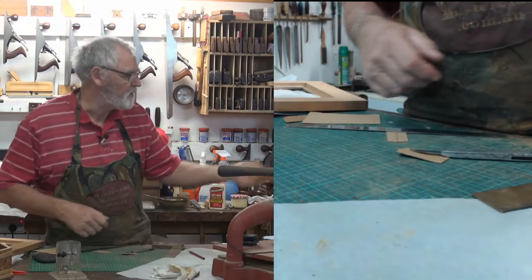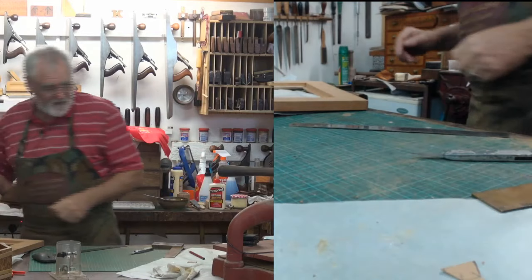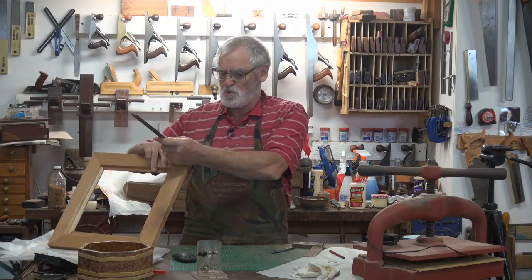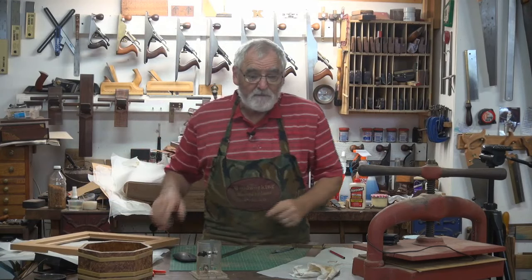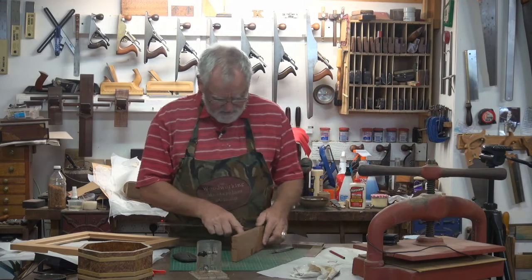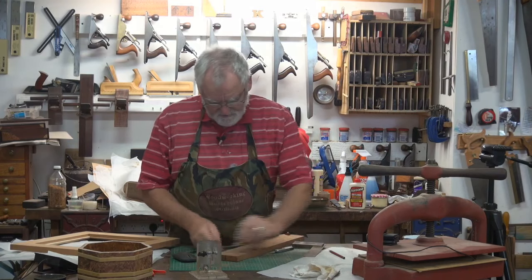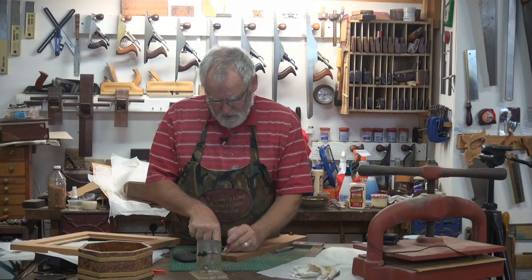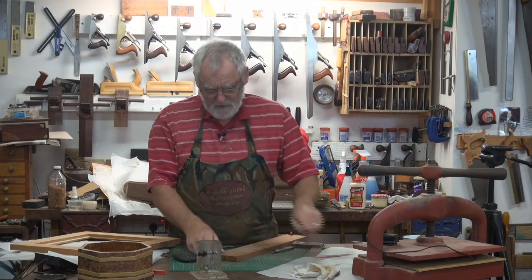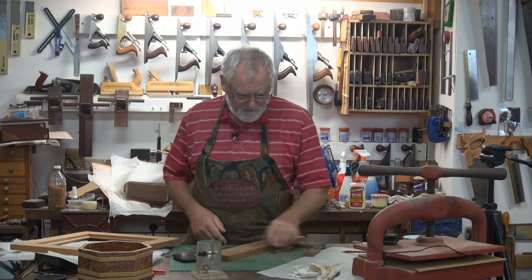Okay. Where is it? There it is. That's the little bow tie. So we'll go and cut a few of those. I don't know how deep I want them. I suppose if we go 10 mil in, so if I cut them at 12 mil, I'll just nip out, see if I can find some 12 mil stock. And I might even have some over here. What's that? That's close. That's about 18 mil, I reckon. It is. All right, well, we'll cut that down to 12 mil. And we'll have a strip of it. It's going to be that wide. So we'll go over the bandsaw. And how many do I want? I only want four. One, two, three, four. Okay, you need that much. Cut that off there. All right, let's go to the bandsaw.